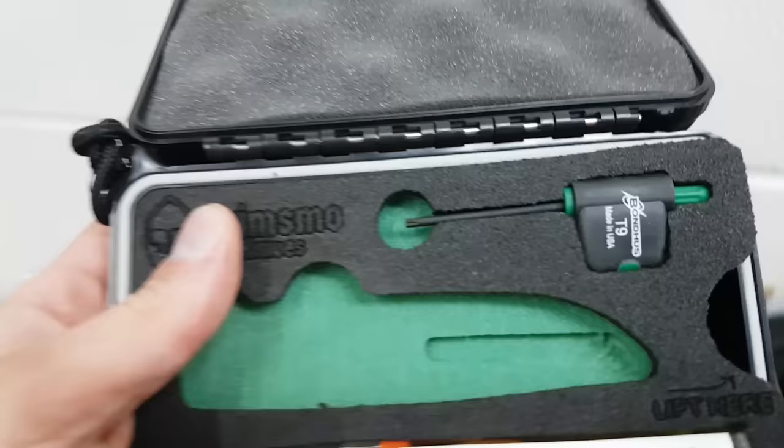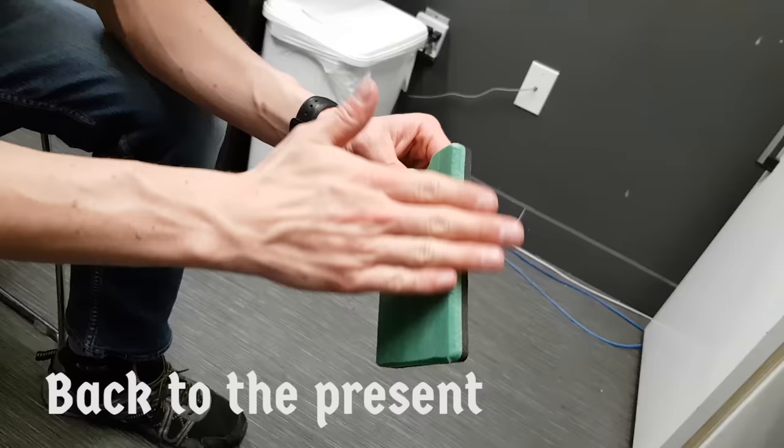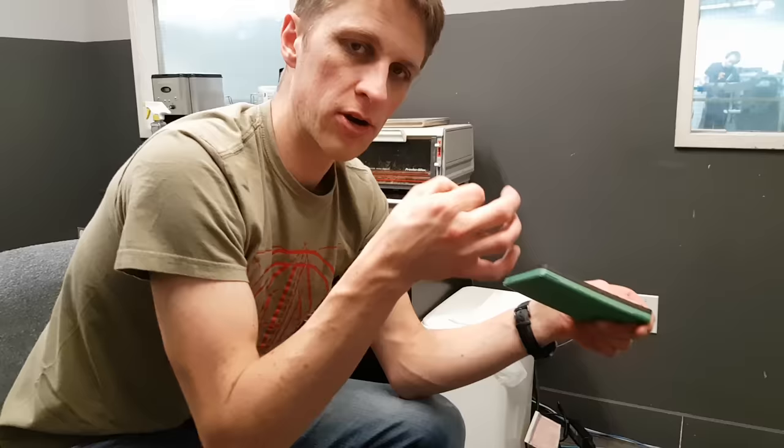The only things that bug me are these little flappies, which we usually pick away when we remember. Where Barry was sanding the corners with the belt sander it worked okay but was very inconsistent. So he has a router table with a corner-rounding bit or round-over bit — he can set this on the table, and it's got one of those bearings on top that rolls around and follows it. That's how we're doing it now and they look awesome.